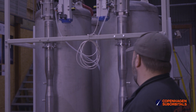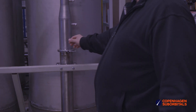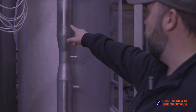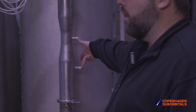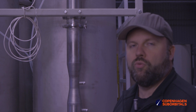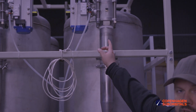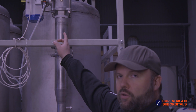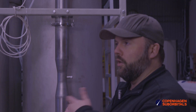Each of them consists of a four-inch discharge pipe, and the narrowing constricted part along with the two pressure ports are part of the Venturi flow meter system — we need to know how much water comes through when we open it. Then we have two large four-inch solenoid valves, which we actuate to open and close for the flows. We can run them either simultaneously or one each.